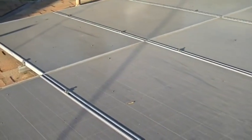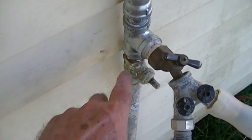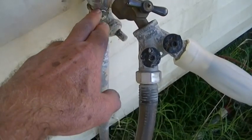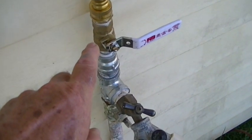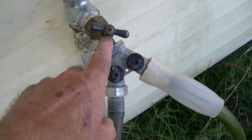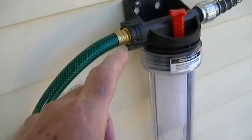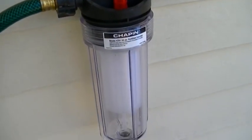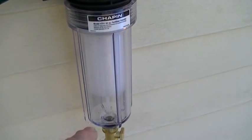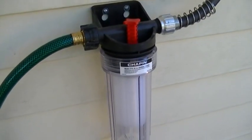I'm going to use dish soap today instead of carpet shampoo — it should work pretty well. For the faucet setup: I removed the faucet and put in a T, reduced down to half-inch threads from the three-quarter-inch line, then added a half-inch ball valve. You need a ball valve because it has a larger orifice — about half-inch compared to a faucet's quarter-inch — so you get the volume you need. The fertilizer injector comes with a short hose; I'll put a link below. Fill it about one-third full of dish soap or carpet shampoo — carpet shampoo works best.